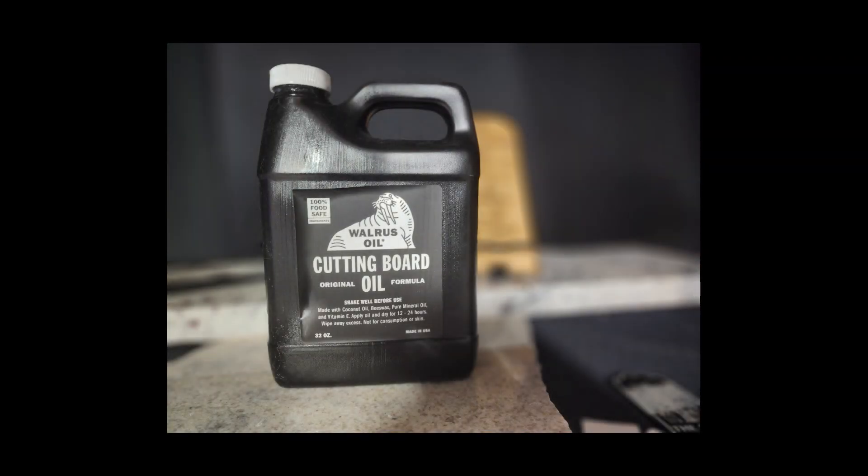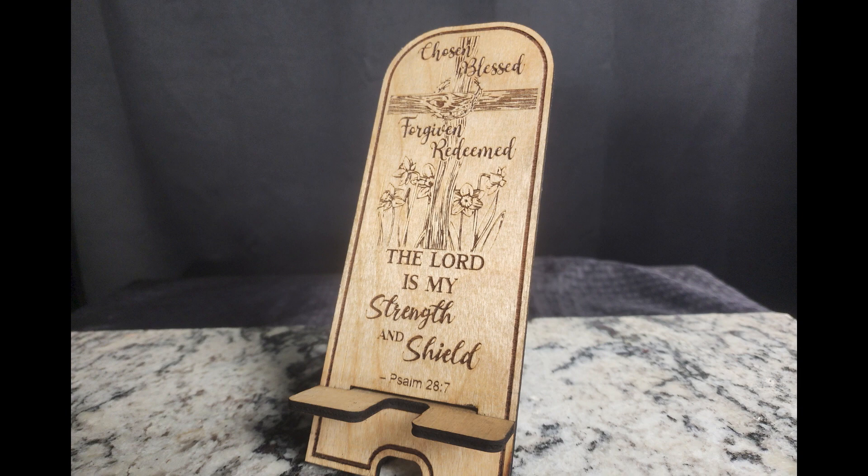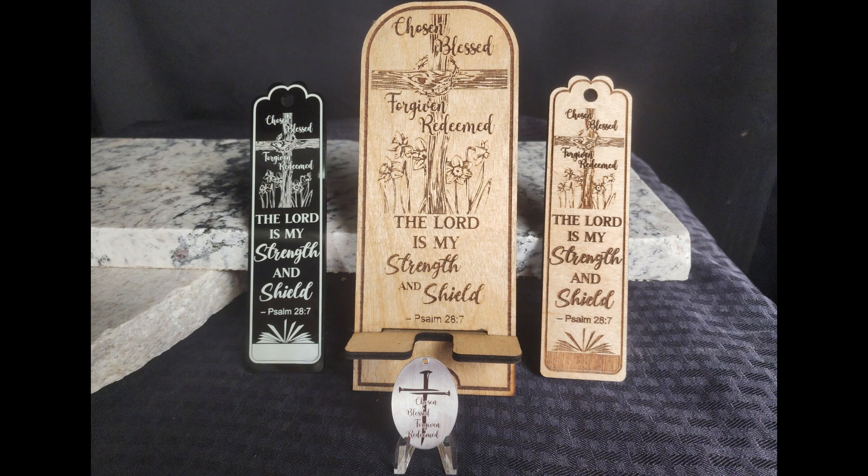Look for the Laser Makers Realm for part one of this two-part video series, which has the file and settings for the fiber laser and the cross pendant. Link will be in the description, as well as the link for the file downloads. I also wanted to tell you about Walrus Oil — it's a cutting board oil, great for finishing anything that will come in contact with food or where you don't want more toxic stains. I'll even use it on bigger wood projects that won't be outside. Put one coat on, let it soak in 24 hours, add another coat, let it soak in, and you end up with a nice, deeper, natural-looking finish. Thanks again everyone — have a great day.